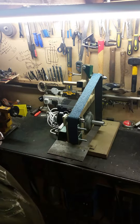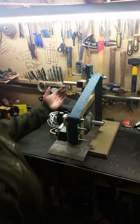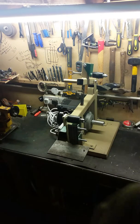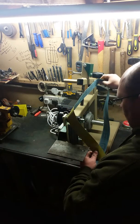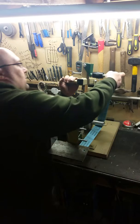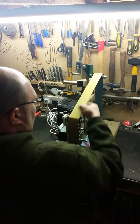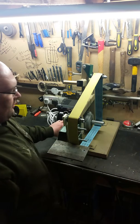So there you go, you saw the belt tracking from side to side. To change belts, it's pretty simple — I'll show you. Put your handle down, remove your belt, get your next one. Same way you did the first one: over the top roller, bottom roller, driving motor. Pop your tension down, slide your belt on, couple of pulls, just check its alignment and then power up.